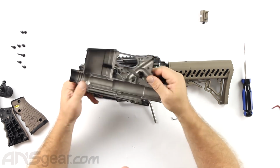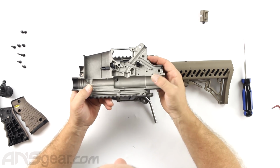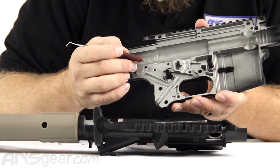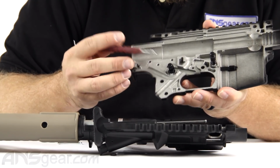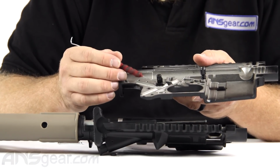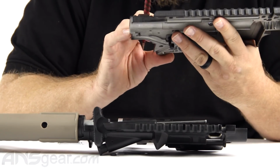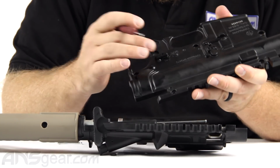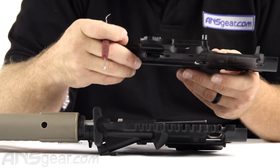All right, now for the trigger assembly switch right here, again, another thing that I don't recommend you take apart. There's no real reason to take it apart. If you needed to, very hard to see, but at the base of this part down here, there is a C-clip that holds the post in place, which then holds the outside in place. If you wanted to take this piece out, you would have to pop this C-clip off of the post, and then the whole thing would drop out the other side. But remember that there is a bearing that sits underneath this plate right here, and it's what locks it into its two positions right there. So if you pull this whole thing off, be very careful that you don't lose that bearing that is underneath there.